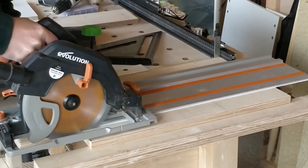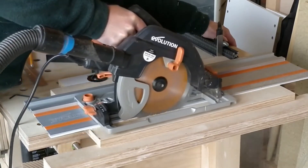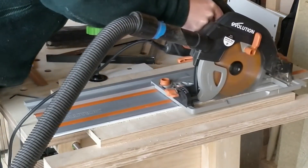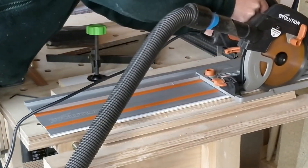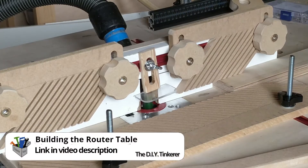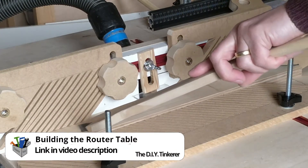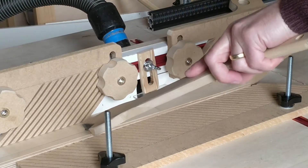The lower part of my fence is removable and this is where I'll fix the box joint jig to. So I cut some 18mm birch ply left over from my workbench build using the track saw. Then because I don't trust my track saw to make a decent cut, I set up my router table as a mini jointer and square up the edge.